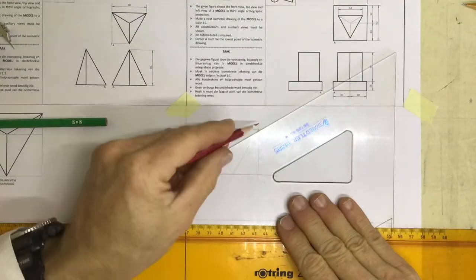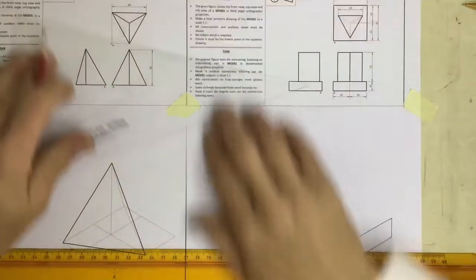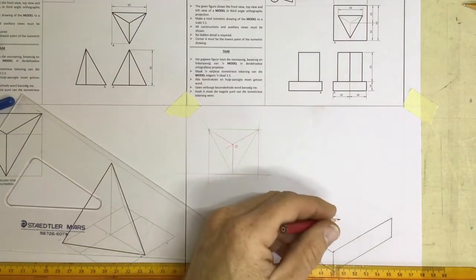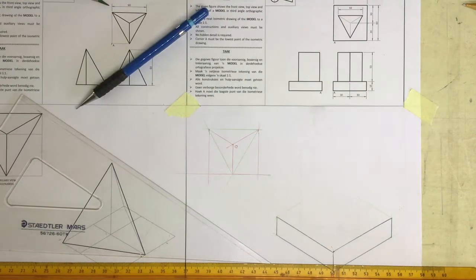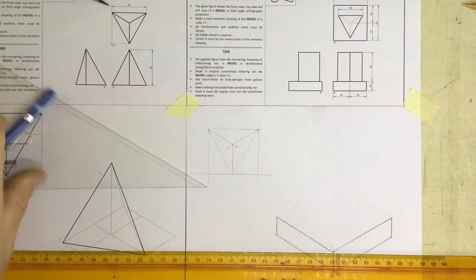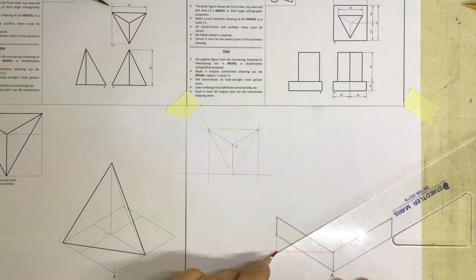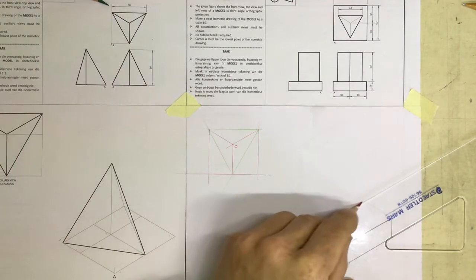Or I could just find the center of this thing, which might actually be more useful to us. So I'm going to find the center — the 30 degree line that I just drew, a 90 degree line going over there, and a 30 degree line going over there. There's my center — let's call that O. What I'm going to do is find O on the base over here. It says that I go 30 millimeters back. So I can take my pair of dividers and measure off 30, or I can use a nice simple technique to find the middle of this line over here. I'm going to draw a line coming out like that, a line dropping down like that, and if I draw a line going back at 30 degrees I've found the middle of that line, which means I've got 30 millimeters going that way and 30 millimeters going that way, which means I can draw a line coming across over there.